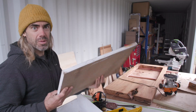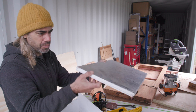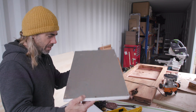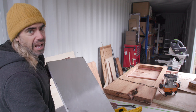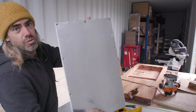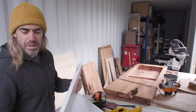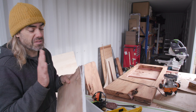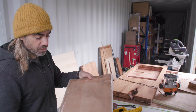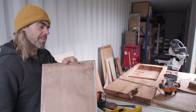It was windy last night. I built this post box a few months back and it's pretty solid, pretty thick. But the wind would have been so strong that it lifted it up and pushed it hard enough to rip the screws out of the back of it. Partly they ripped out because the ply was getting wet — you can see it's all delaminated. I should have painted this surface and never did out of laziness. So before I do anything else today, I'm going to sort this problem out.